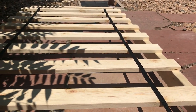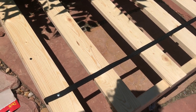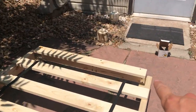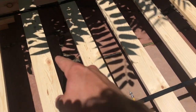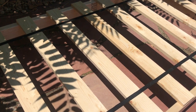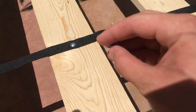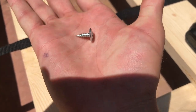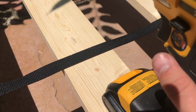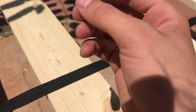So now I've done some math to figure out the length apart that the beams need to go, and then I've strung out the ribbon that I'm going to attach to the wood. I've anchored down the plate at the far end and made sure all the spacing is correct — I calculated 4.75 inches in each of the spaces, using a measuring tape. Then I strung up the lines equal distance on opposite sides. Now I'm screwing all of the plates in. They're little screws but with a really flat top head, which is good on this type of material. Normally I would use a soldering iron to pierce through, but these are going in really well and not stripping the nylon too much, so I'm just anchoring them in with the impact driver.